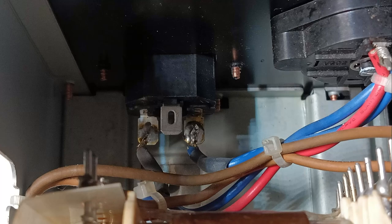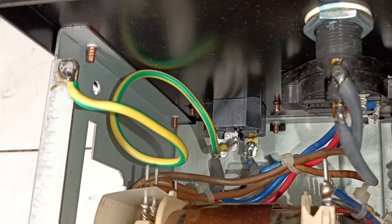Another interesting detail is that the power cord includes an external ground connection, which however is not connected. Considering that the internal power supply is not well isolated, and that there can be some leakage current between the metal cabinet and ground, it could be a good idea to connect the external ground to the cabinet for safety.